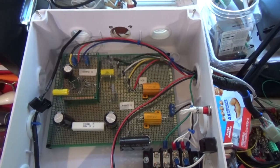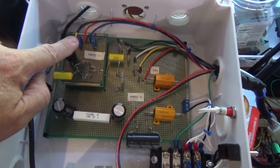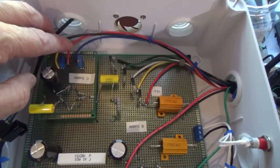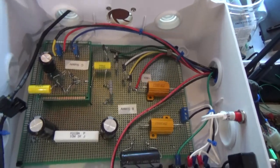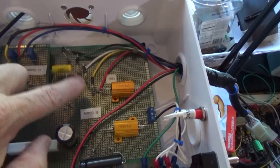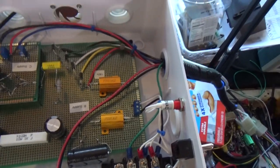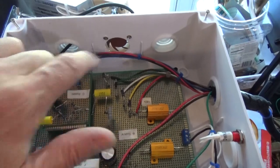Okay, so this is the power supply that we put together, and if you remember, this is our C section, this is our B+, and this is our A. So the wire that I had to change for the negative voltage is right here. I had it going to the wrong side of these pots, these trim pots, but everything else is good. I have the 5-watt diodes in here. That's working well, and I've got my dropping resistors here, and this thing does not generate much heat, which is really, really good. I do have a fan in here, which I'm not going to use yet.